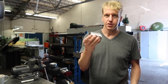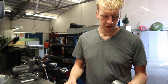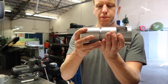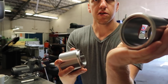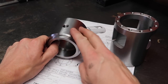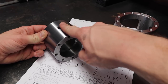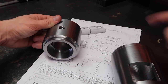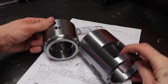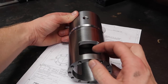At this point we have finished the extruder bearing housing and the transition piece. These two parts will form the basic body of the extruder. We are going to assemble them now by preparing them for welding and press fitting them together using the press on these locating rings. An important thing to look out for while assembling these two parts is the positions of the holes. The bearing body has the grease nipple on top, and this hole is aligned along the center line with the grease nipple. The slot in the transition piece should also be in the upward-facing position during assembly, with both holes aligned with each other.